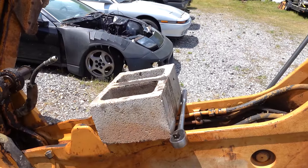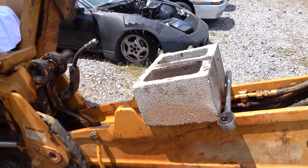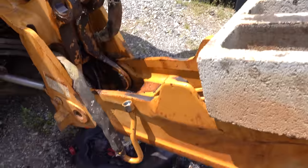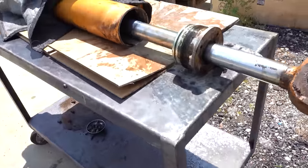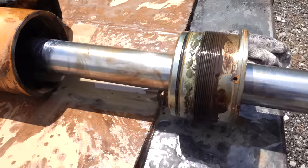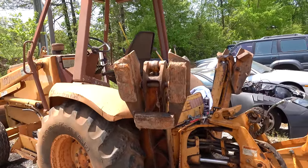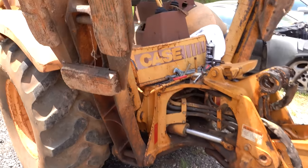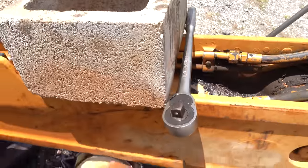All right, if I'm out of breath, that's because I just hoisted that thing out by hand. It's not light. It's about three hernias heavy. I also discovered as we went over that a lot of the oil that is in it is in fact water. The angle it was sitting at with a completely wiped set of seals let a lot of water in, which now tells me we're going to have to drain all of the hydraulic oil out of this machine just to make sure there's no more water that can potentially damage something. Whew, very expensive, but I learned something.